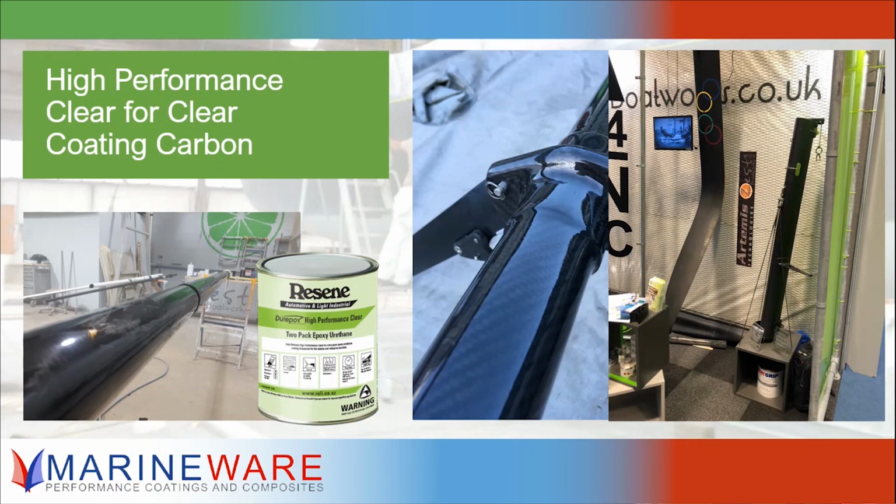But the overcoat window on the high performance clear is 2 hours. So when you put one with the other, which overcoat window do you work on? Personally, you're always in such a hurry to get these things out the door commercially. Everyone wants their boats back on the water. You tend to say 2 hours is 2 hours is good. Yeah, I want to be sanding down my Durepox in 2 hours.